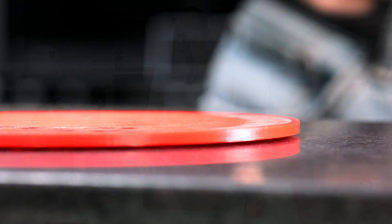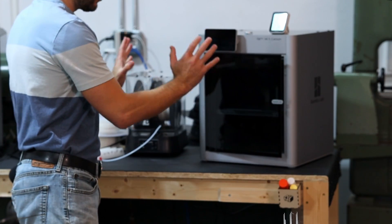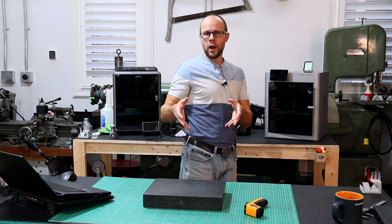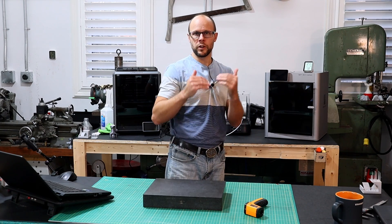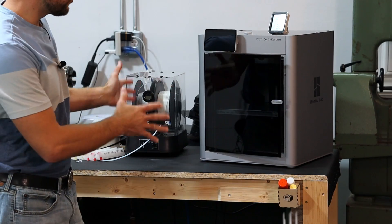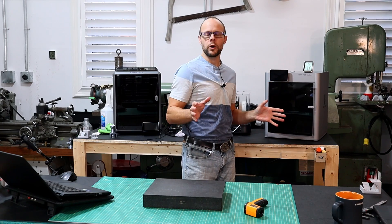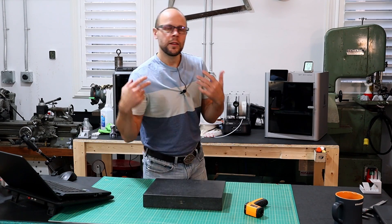One of the most important features of any 3D printer is the enclosure. It's going to reduce the rapid rate of cooling we would see while prints are running, and reduce the temperature difference between the highest and lowest points. Another benefit of the enclosure is that it can allow the part to cool a little more uniformly after it's finished. So let's get some prints going.